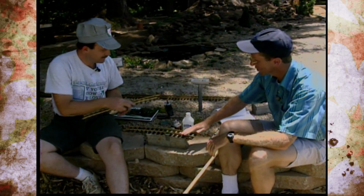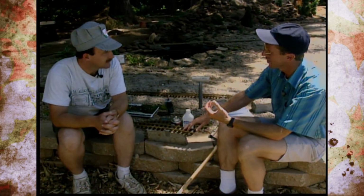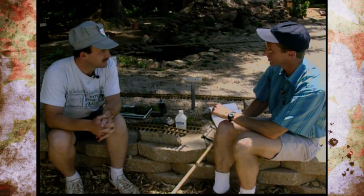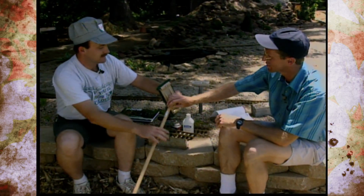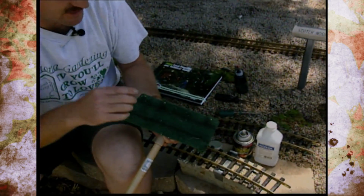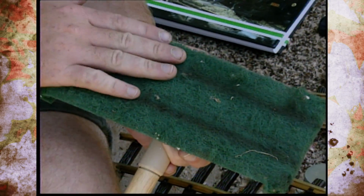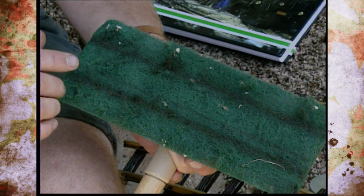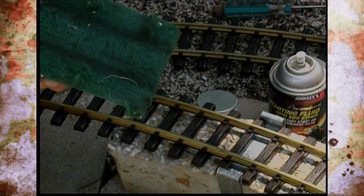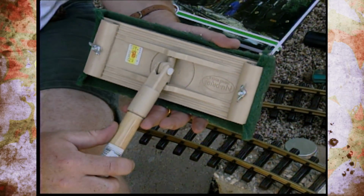I think the contact, again, once it was in, we're finding is important, because ants can leave honeydew and dirt and dust and tree limbs, so occasional cleaning, but also it's important to polish it. And what have you devised there, Alan? Yeah, well, just the environment has some corrosion factors on it, and what we found is that we just used a polishing pad, or some people call it a scouring pad, to polish the surface of the track and remove any debris. And it just fits on the back of a pole sander for drywall.